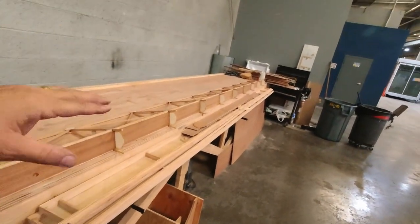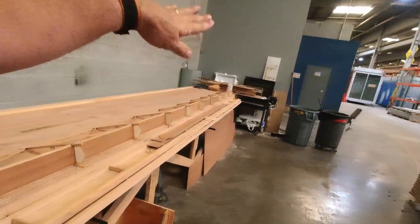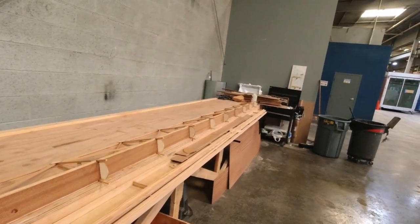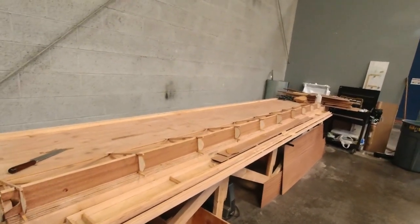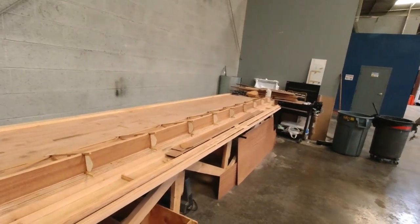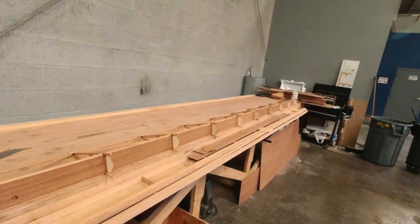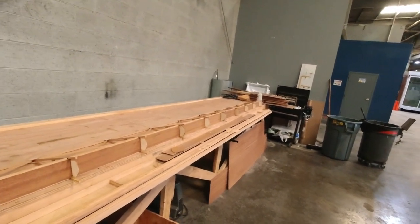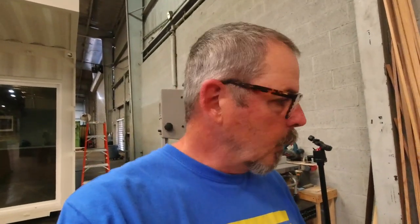Get this whole section cut off, rounded off, prepared, and then after that's done, we'll finish the wood with the bare thing, just like we did on the leading edge of the wing. We'll finish the inside of the plywood the same way we did, and then we'll line everything up. We'll preform the 0.8 millimeter plywood in a similar way, although we won't use an actual form. We'll just put a couple of boards down on the bench, and they'll kind of bow and go between them, and that will hold that. And they'll probably pull them a little closer together, so we actually overdo it a little bit so that they come closer to holding that shape. I sort of remember that from the last time I did this. So anyway, I will get busy cutting these off, and we'll go from there.